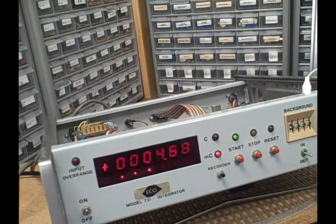I waited until the watch hit a whole number, then connected and let it run for exactly 60 seconds. We got 60.77 millicoulombs. The 0.77 is most likely my connect and disconnect time. I'm going to assume this thing is actually doing what it's supposed to do.